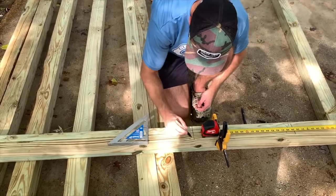And after completing the side trim, it's time to install the PVC fascia trim boards. The fascia trim boards are 7.25 inches wide in order to cover up the actual 2x6 lumber that we framed behind it. So as you can see here, we lifted the piece of trim and got it flush with the front of the shed, and then we tacked it in place with framing nails. Now we're going to install the partial piece at the back.